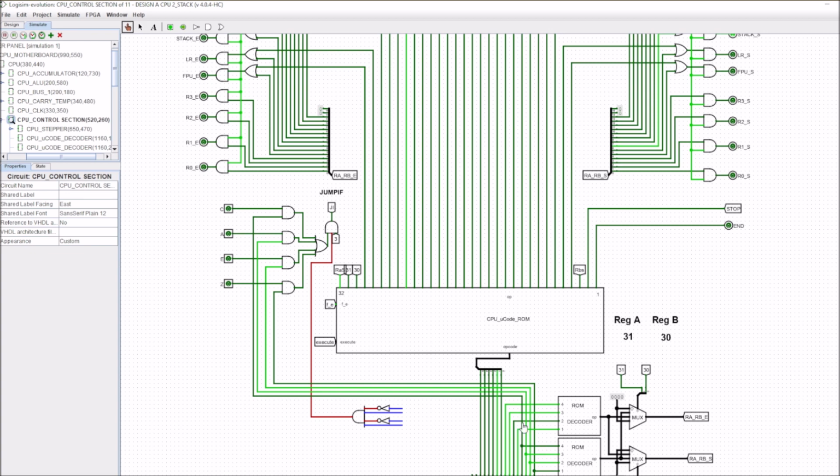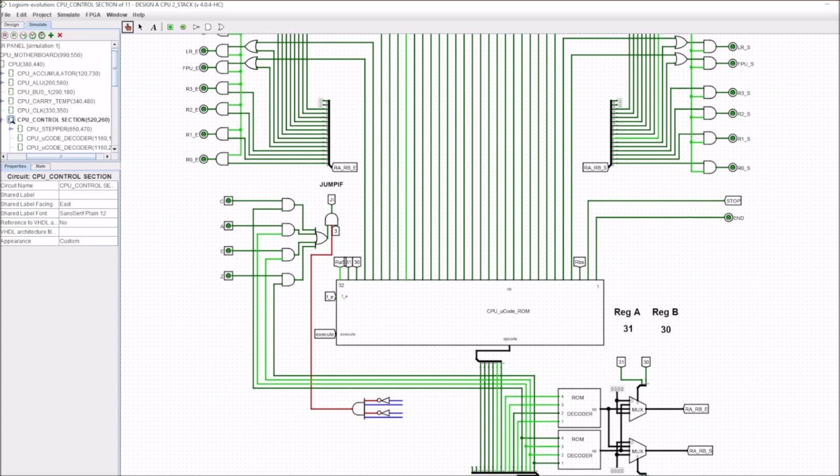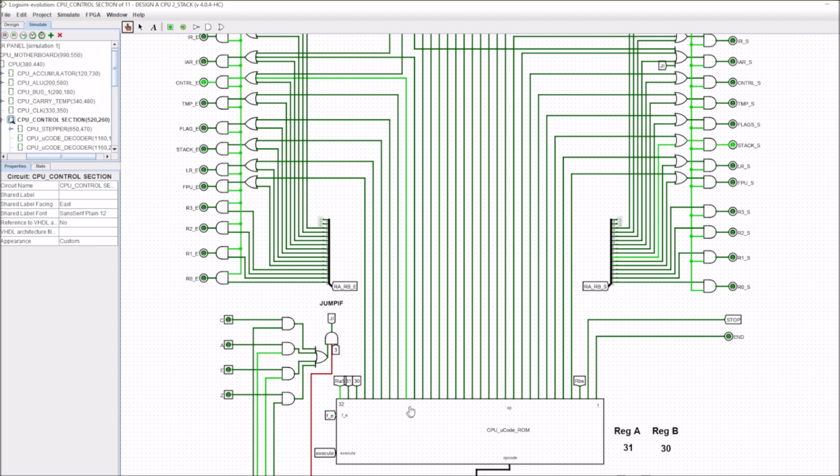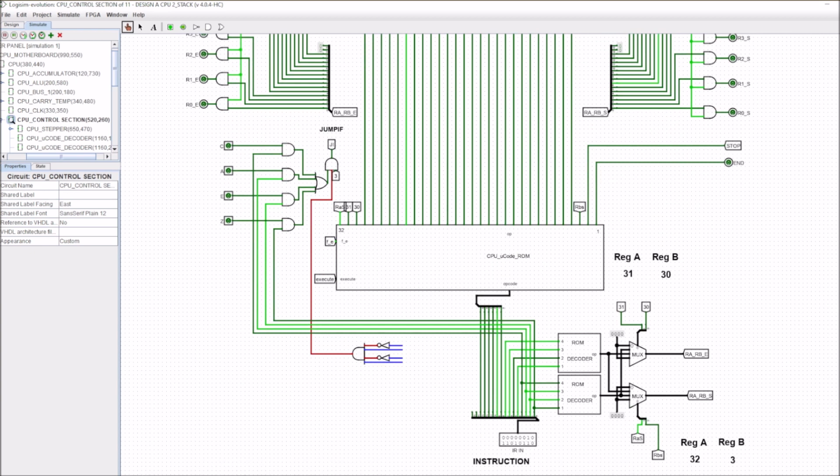So you can see we're using partly the instruction set here from reg A and reg B, and we're also using the value from the output here, which is the output of the microcoded control unit, and it is choosing the control enabled. And we're just at the second part of this particular instruction, which is the data instruction. So this is a good point where you can see that we're using both the, if you like, the hardwired section here, and the microcoded control unit. So we're using both of them in order to make the control unit as general as possible.